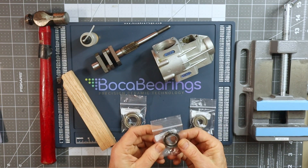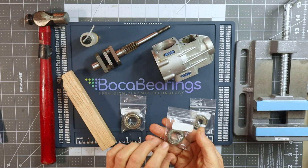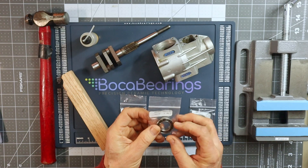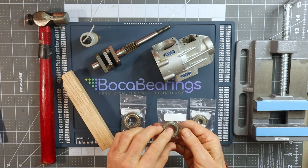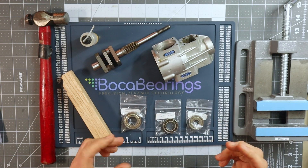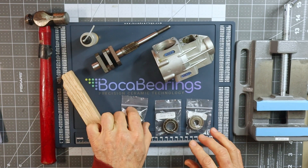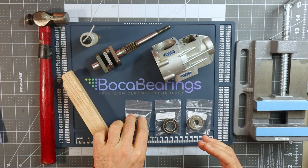The mid bearing that came out of this engine was open on both sides, but this particular one has a front metal shield and then a plastic retainer. I'm going to keep this just as it is and not do any modifications whatsoever or remove the front shield. It's been my experience that it's really not necessary to have open shields in these things, because none of these bearings are hermetically or permanently sealed in this kit.